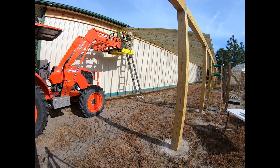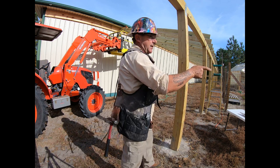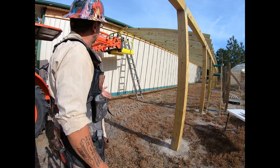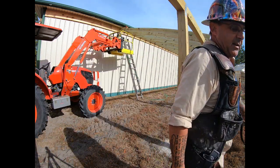Get it in. Toenail it in. A lot of people, when they use joist hangers, don't toenail them — they believe joist hangers are the greatest and strongest thing, and they are not. I'll take a toenail over a joist hanger any day, but I still put them on anyway. It's not like I don't use them, but I don't rely on the joist hanger to hold it. Then I'll repeat the process — cut the next one, do the same thing next to it. Then I back the tractor up two feet and do the next two. That's basically how it goes.